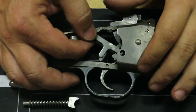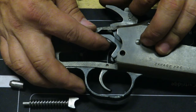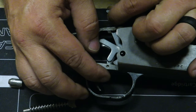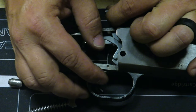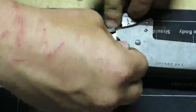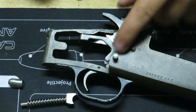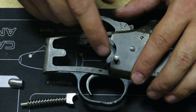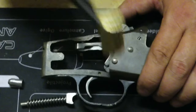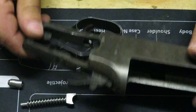Put the trigger down, line that hole up. You're going to have a little bit of tension because of the trigger spring in there. Go ahead and put that pin in there — work your hammer to where that pin goes down in there. It shouldn't take any pressure at all, just got to line it up right. You saw how that goes in there pretty easy — it's a little bit smaller on the other side so it retains like it's supposed to. Go ahead and put that in there like such.